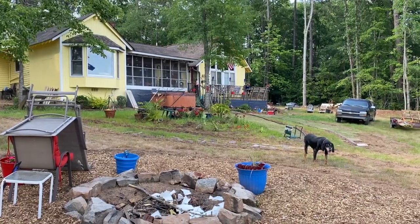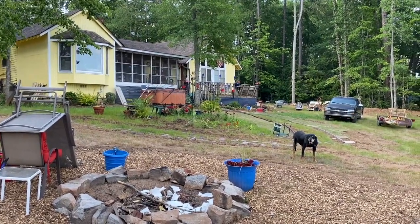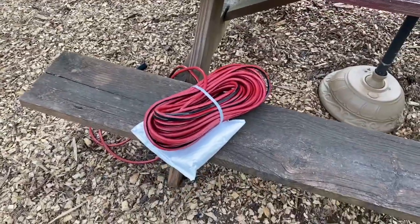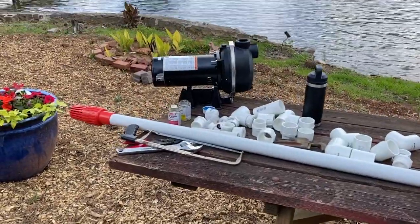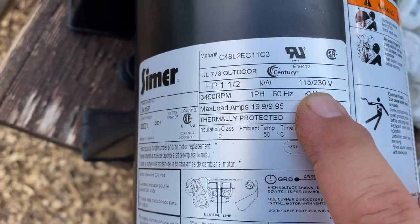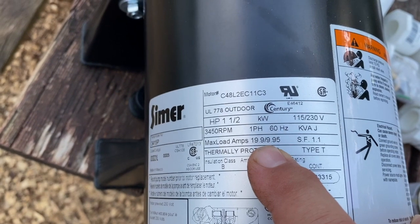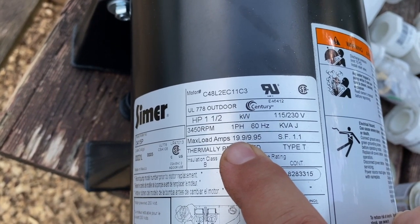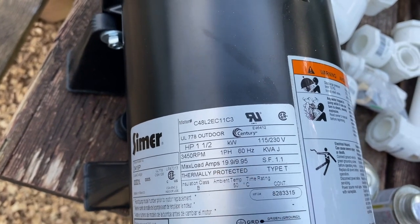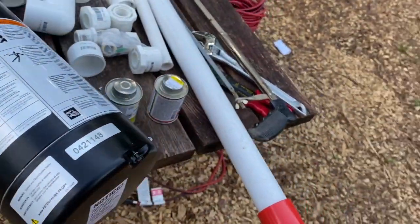What I'm going to do is a hack to get 220-volt power down here, because this pump will run on 220 or 115. I want to run the pump on 220 because I can use a thinner gauge wire — 14-gauge wire on the 100-foot extension cord. At 230 volts it only pulls 10 amps max, probably not sustained. At 110 or 115, it pulls 20 amps, so I would need a much heavier wire and it would interfere with my hot tub. I can spare 10 amps on the hot tub easily; I can't spare 20. So that's my plan.